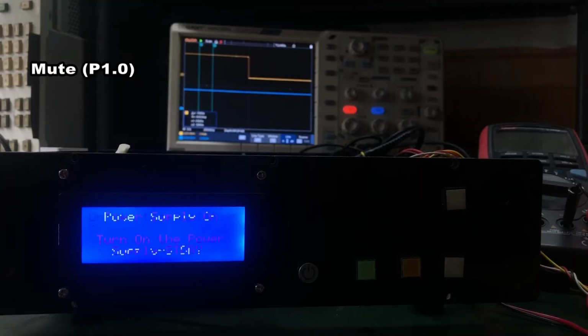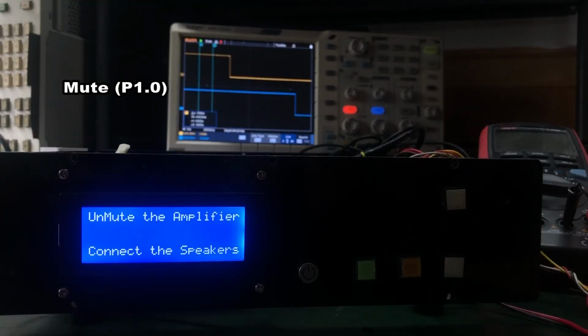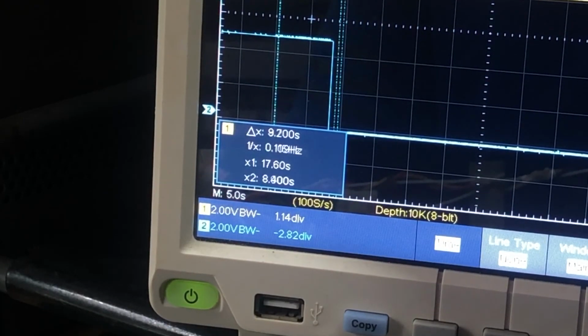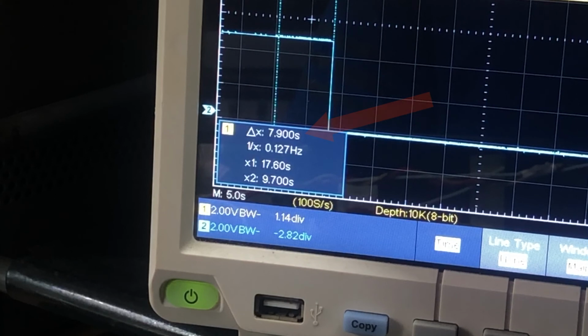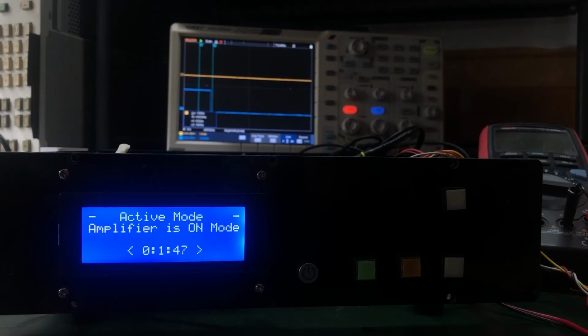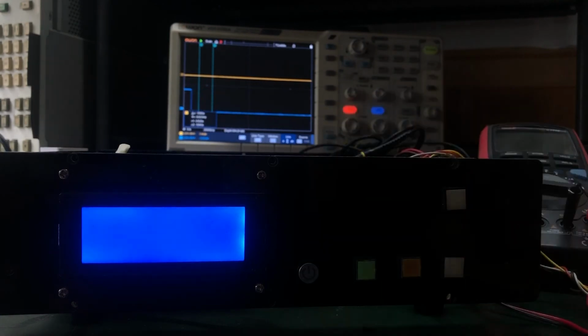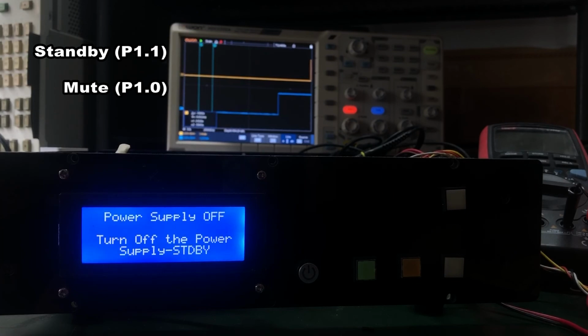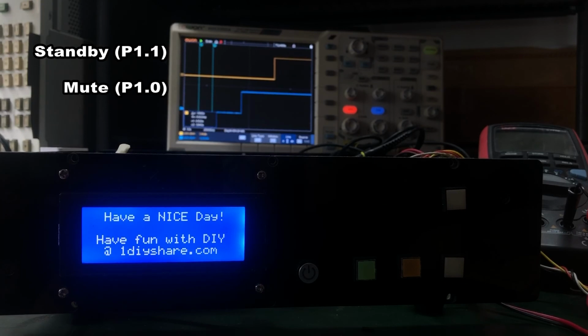The mute will be delayed by a few seconds, meaning the speaker is not connected when you just power on the DR100 concept amplifier. Normally it is about 6 seconds after turning on the amplifier, which gives enough time to stabilize the amplifier and kill noises. And then it goes logic 0 in the power on, and it goes logic 1 first before turning off the amplifier.